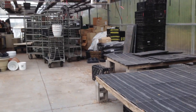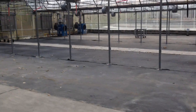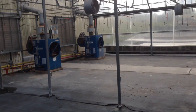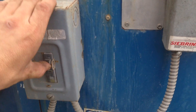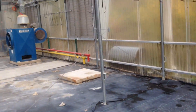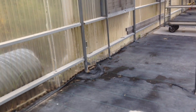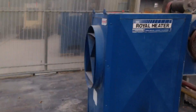If you're anything like me, you'd like to hear the generator under a load. So what I'm going to do is put all the furnaces on manual. These are about 1.5 horsepower electric motors that drive the blowers on these things. Let's flip all these on manual. There used to be a third one right here, but that's down in one of the other greenhouses down the hill — gone, all capped off. No plans to add a future one, as three heaters have proven plenty to keep these three greenhouses warm.